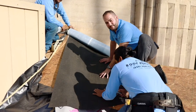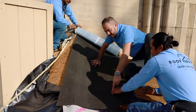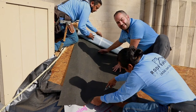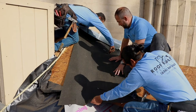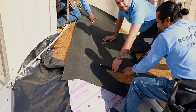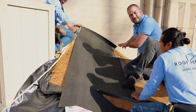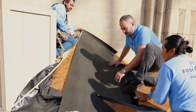We've got our ice and water shield in place right now. We want to align it so the center is in the valley, then we can start cutting along our edge. We're also going to come up past the peak of our valley and make a slit here to be able to fold it to the other side. We're cut flush with our drip edge here, and on this side we're flapping over to the other side of the valley. When we install this piece of ice and water shield, we'll flap on this side and have a nice hermetic seal all around.